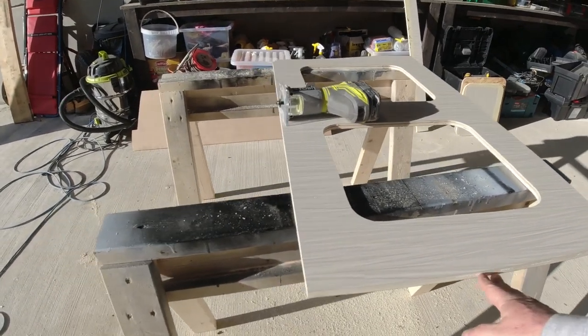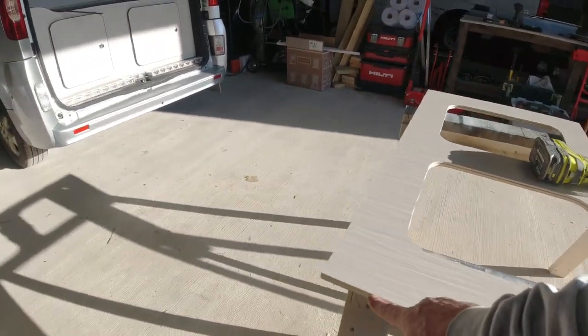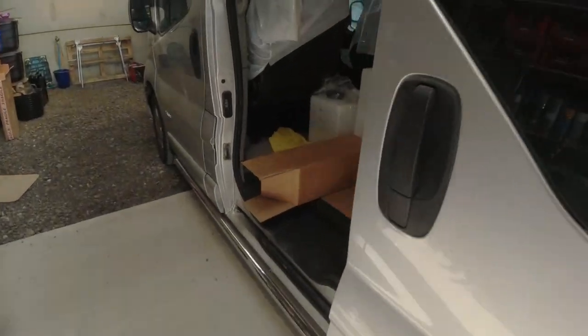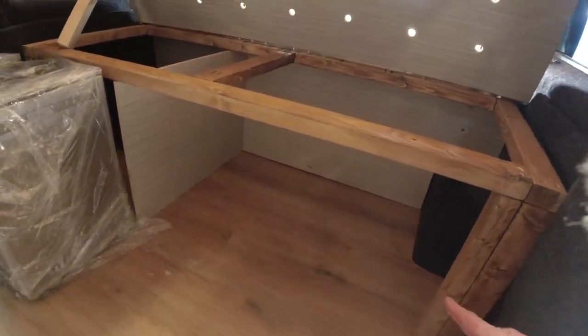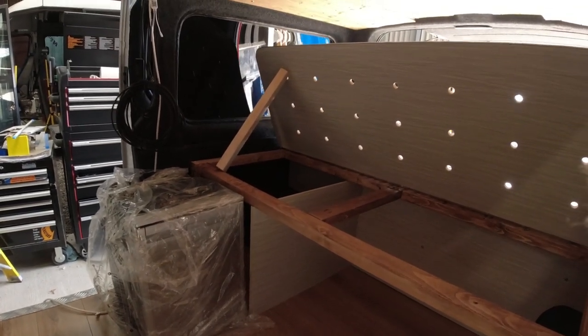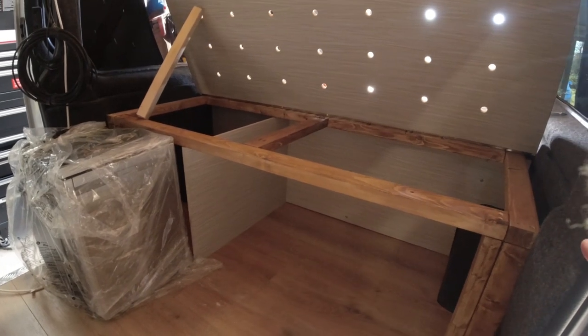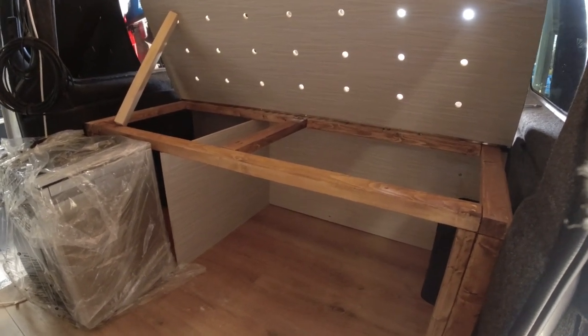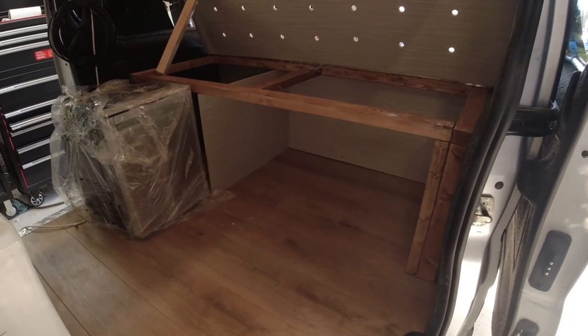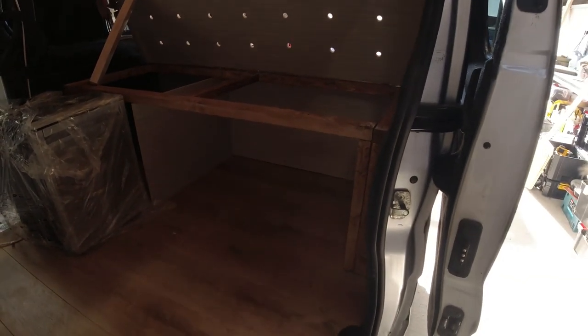Hi everybody — good morning, because it is morning. This side is going to be meeting another piece of furniture board, so I'll be putting a slot all the way around here for the T-trim. That board is going to go in here, and hopefully today I'll also get the side board cut — that will be the side of where the kitchen starts. I'll come back once I've cut that board and put the T-trim on, since I've already shown you that on the bed build — no need to show it twice. If you have any questions regarding T-trim, cutting furniture board, routing or anything, leave a comment below. I've finished the panel in the back — let's have a quick look.